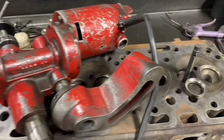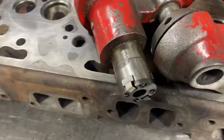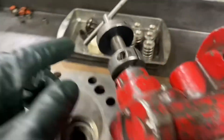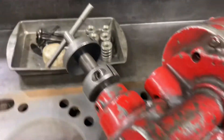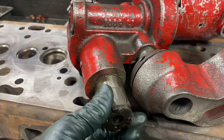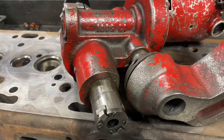It has an adjustable cutter head right here. The tool goes down through and you can spin it — there's a taper — and I put these cutters in here. I've set my interference fit to 8 thousandths.